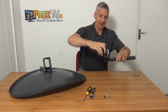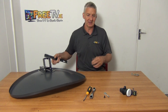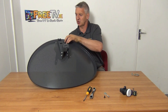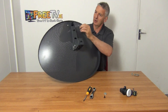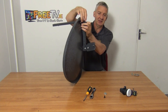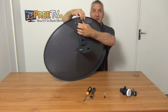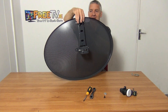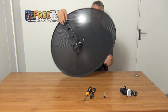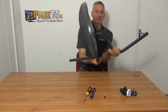I won't bother putting the LNB on right now, but that snapping mechanism is extremely easy to put on and extremely difficult to take off, so just make sure you're putting on the correct LNB for your requirement. Within the LNB range you have singles, twins, quads, hybrids, and octos — eight-way units. I'll slide the arm through, tighten the bolt, snap on the LNB, and all of a sudden we have the dish bracket hanging off the wall and our fully assembled satellite dish.